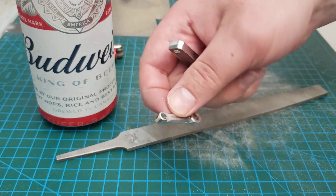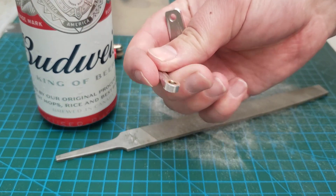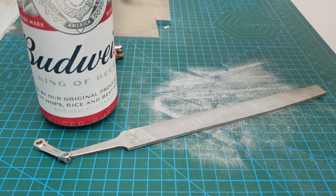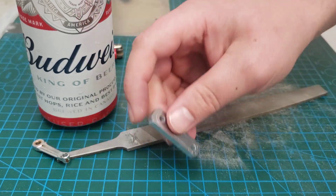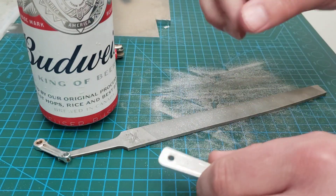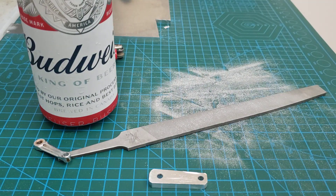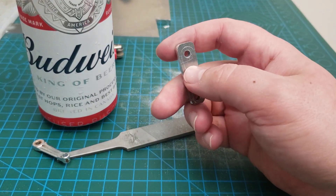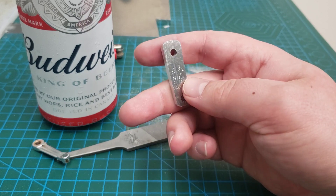Versus one of these stock rods — because these around the three-gallon mark start to get shitty, a lot of slop here and there. So it should be interesting. The Pro 15 with the handmade rod has about a gallon so far, and if you hold the piston still inside the engine and rotate the crank, there's no up-and-down play, no slop at all — it's almost perfect. Eventually when I have enough cash, I'm going to save up and buy a drill press and probably a small lathe if I can find a place in my tiny place to put one.